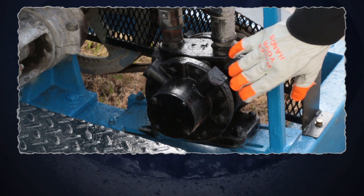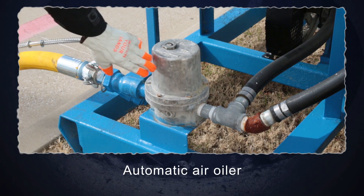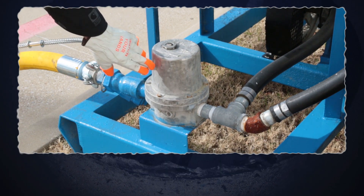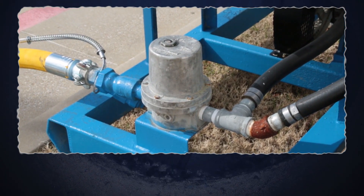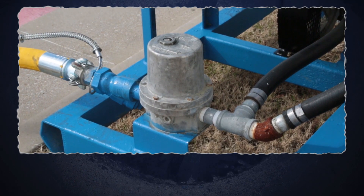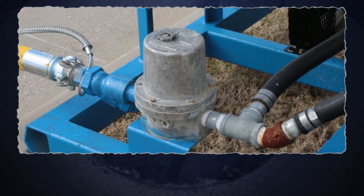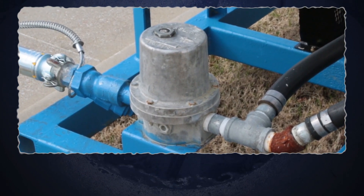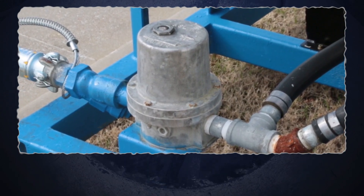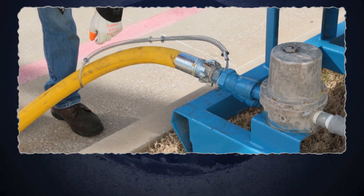The belt is guarded to protect hands and feet. There is an automatic air oiler used to supply oil to the air brought into the grout plant to help lubricate motors and keep them functioning properly. You do need to occasionally make sure it's still full, although this type has a relatively large capacity and should maintain for several grouting operations. If it ever has to be taken apart, make sure the pressure is relieved first. Attached is a cable that serves as the inlet for air brought in from the compressor into the grout plant.